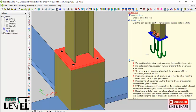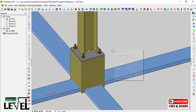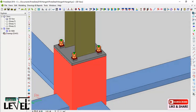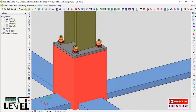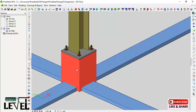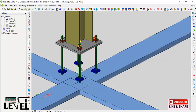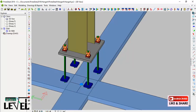After configuring the anchor bolt properties, I click Apply and OK. Then I pick the anchor bolts, right-click, and select the plate to place them exactly in position. I interrupt the command and orbit around the model — this is it, the model is complete. You can also isolate the reinforced concrete column by right-clicking and selecting 'Isolated.'